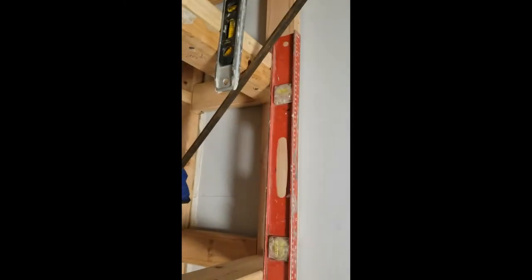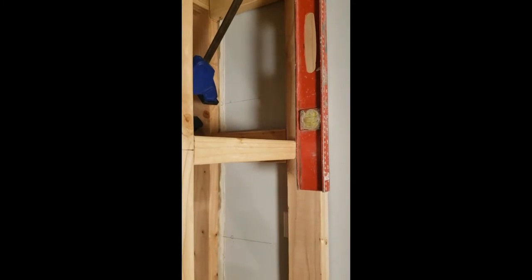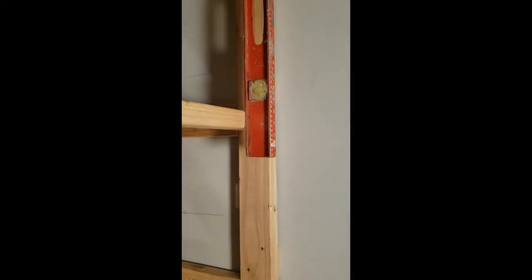As you can see, I went first and marked where all the studs are on this wall and all the way around. I'll go ahead and put three, four, five screws — about four-inch screws — through the two-by-fours into the studs behind the walls to secure it and level it. We'll come back when we start doing a little bit of the face trim.